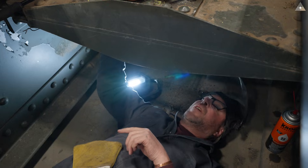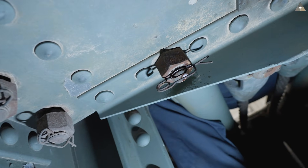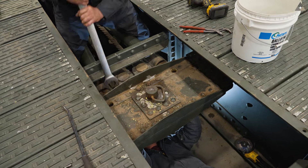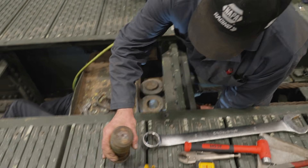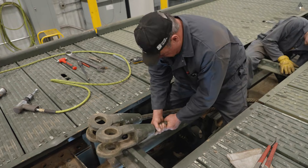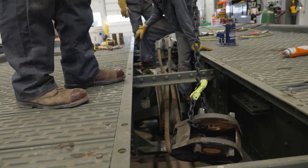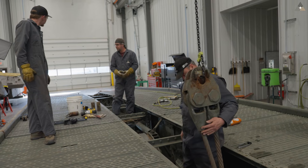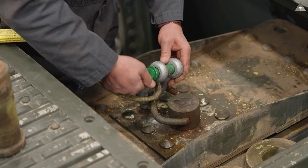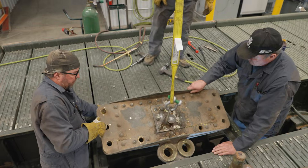All these bolts are loose and just have a safety pin on them so that the bridge can flex and not break. When we remove this assembly we have to be very careful not to damage them because they have to be a match set. If one cable is stretched and one cable is not, it could affect the geometry when we try to deploy the bridge. With the pin still holding, the entire assembly comes off so it can go to the press.